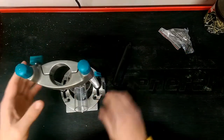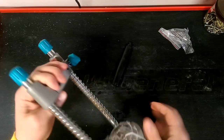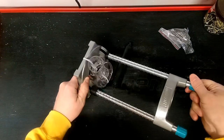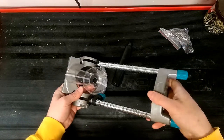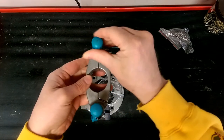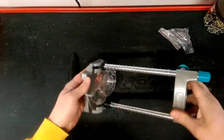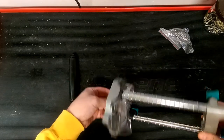This comes with a metal base and the slide mechanism. Really the only thing plastic on here is some of the adjusters. This thing can move up to a 45 degree angle — just loosen up these ends here, and that allows it to come off 90 and drop down to 45 degrees either way. It's got a little indentation or shoe there that fits right in at the 90 degree mark, so it's not hard to find 90. This little plastic piece here is so you can hook it up to your shop vac and help keep the dust down while you're drilling.